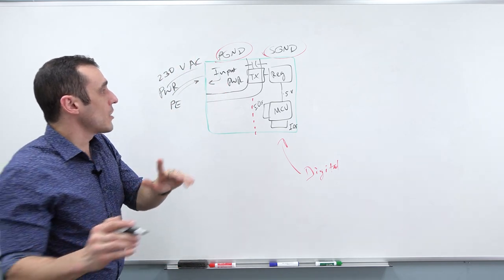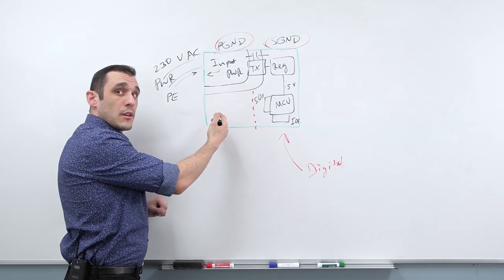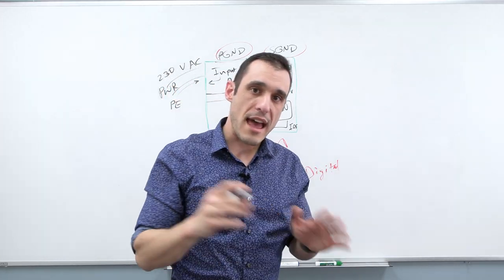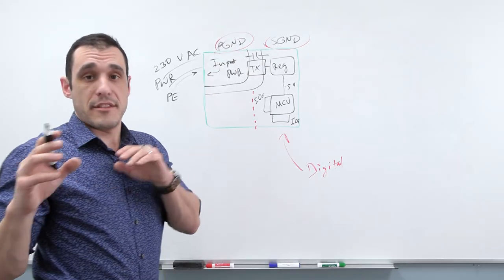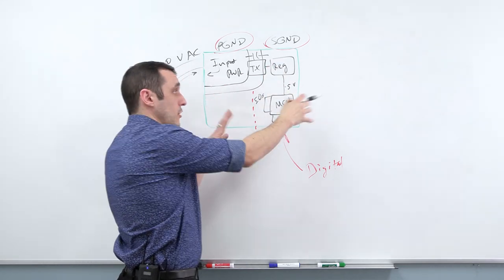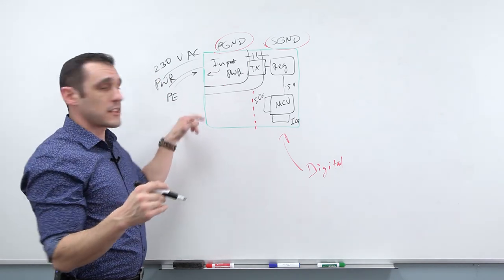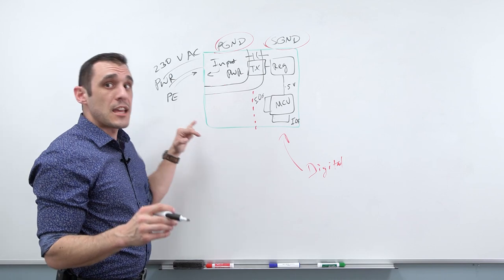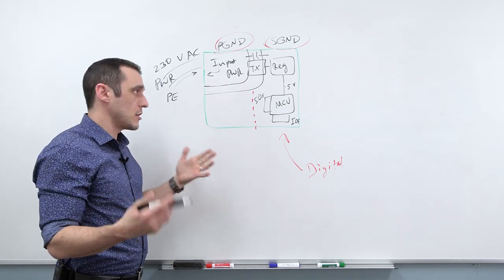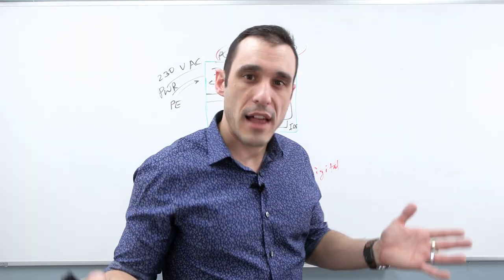We don't always have a PE connection on the secondary side. On the secondary side, we may have a mounting hole that actually connects back to chassis. The earlier video we have on mounting holes — linked in the description — explains how you can use mounting holes to make a connection between your system grounds and the protective earth through the chassis. Remember: protective earth is not being used as a return current path. It's being used as a shield or a place to dump ESD or any noise, so it doesn't interfere with your circuits.